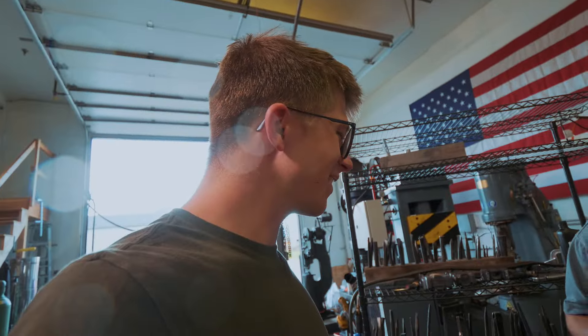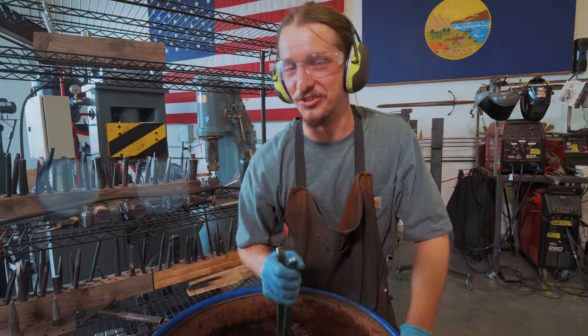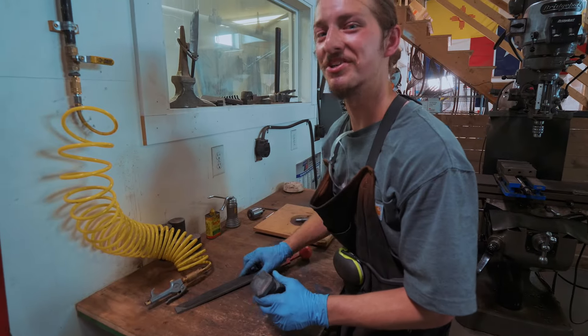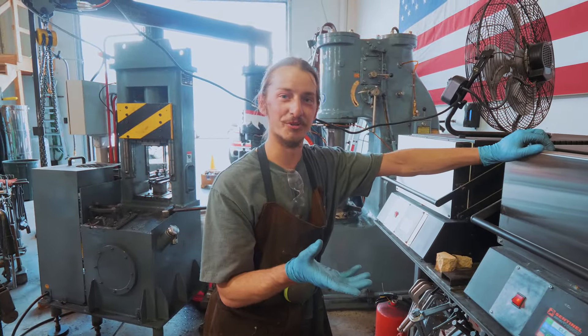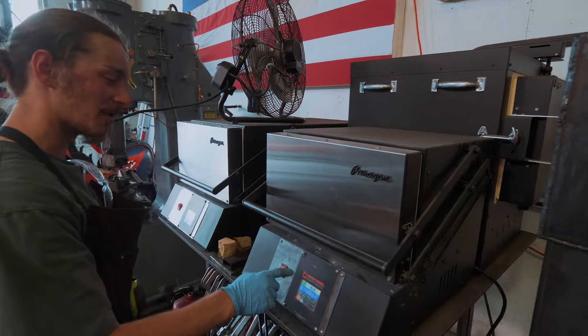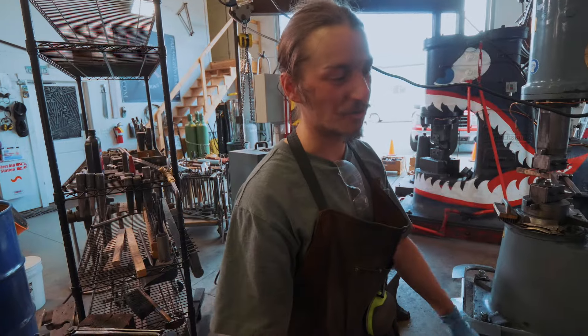Sam, that is awesome — I had no idea you were doing both faces at the same time. Yeah, that was really recent. I was just getting really tired heat treating and wanted to be less tired. It's music to my ears. We're going to put this in our Paragon heat treating oven, sold at AlexSteelCo.com. Heat treating ovens are probably one of the most underrated tools in the shop, especially for knives — getting a very precise heat treat. It'll be in the temper oven for two hours at 400 degrees.